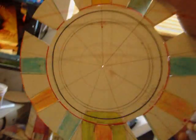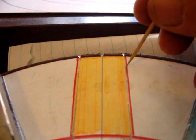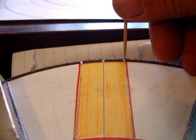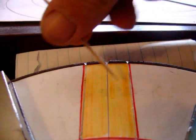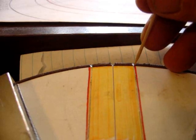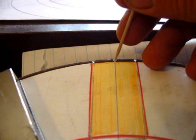Now we have a template. Top dead center on one of your north magnets — notice that the line isn't exactly on the red line, it's just off to the side because that's where the rays are cut. I've got the edge of this little file line. I turn the file sideways like this and use the edge of it as a corner — puts a nice little edge. It lines right up with the edge of the magnet and right up with the edge of the magnet. This one here is top dead center.